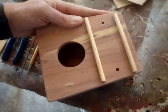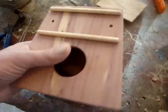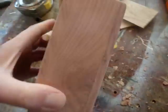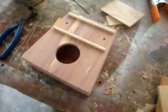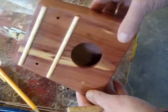And there it is — all glued up. I've just, with sandpaper, rounded over all of the edges — makes it feel a little bit nicer. I couldn't use my round-over bit on my router because I had already stuck these on there. But it works out fine. Now all I need to do is put some lacquer on it and put the tone arms in. Boy, do I like the way that lacquer really brings out the grain in that red cedar.